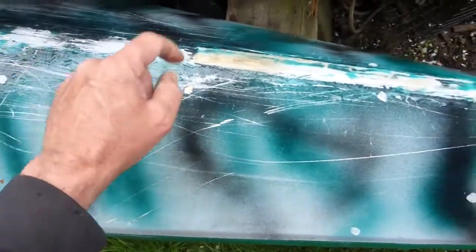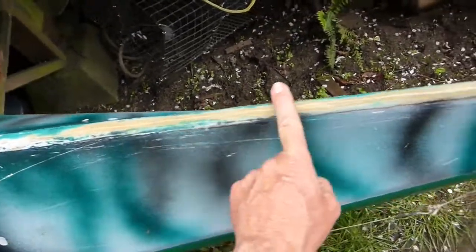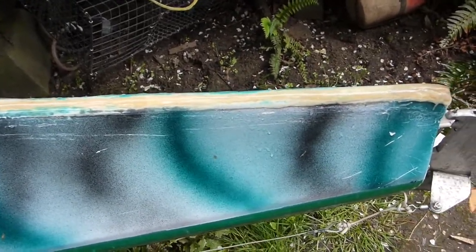In other situations where you have a direct puncture wound, impact, a deep divot chunk out of things, or wear along the keel, it's a lot easier to just mix up fumed silica and resin together in a paste and apply it with a stick.